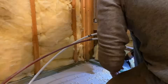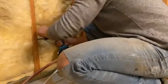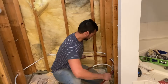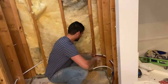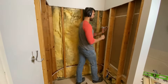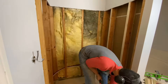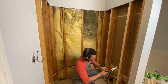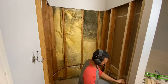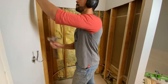I feel like now is a great time to note that I am not a tile guy. I'm not really used to working with water supplies or drainage. I'm just a DIY guy. Hardy board was definitely not the next step — the next step was taking the plumbing that was running underneath the shower pan and getting it rerouted through the studs, so we could tile the floor without the water supply getting in the way. I also went ahead and added some furring strips on the studs so that when we hung the hardy board, it was flush with the existing drywall.